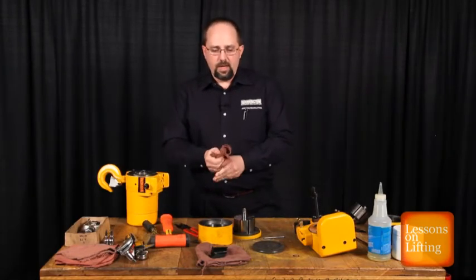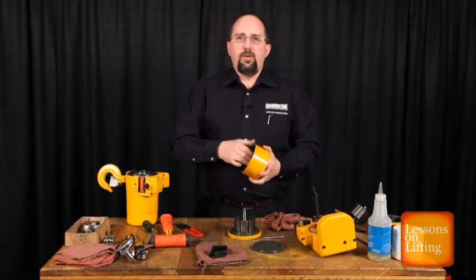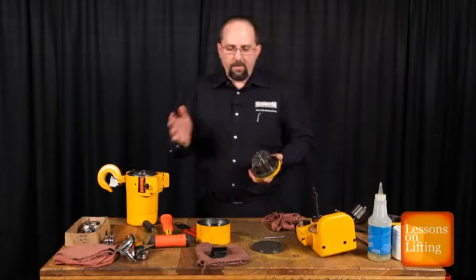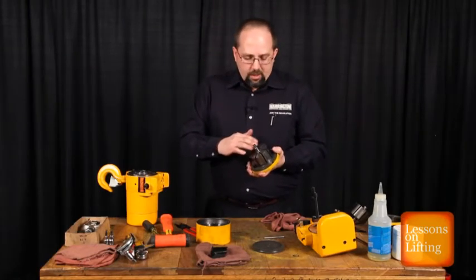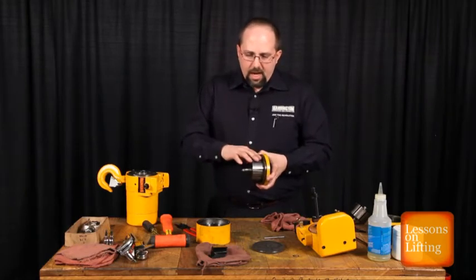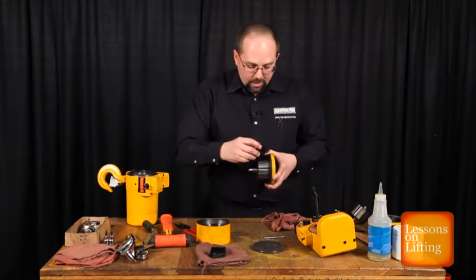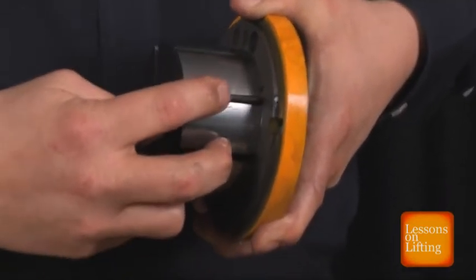Occasionally people ask: what if I have deep scratches? If there are minor scratches in the stator, you can hone that — that's not a problem. Scratches on the rotor: there are very few instances where you'd actually need a replacement rotor. If you run unclean or unfiltered air through here, you can get some scratches on the ends of the rotor — those can be filed or sanded off, it's really not that critical. The face of the rotor never really touches anything other than the springs, so as long as the vanes and springs slide in and out of the grooves in the rotor, you're in good shape.